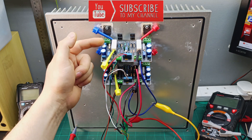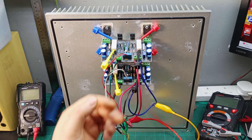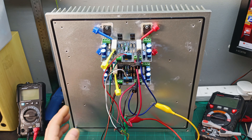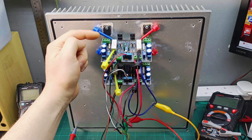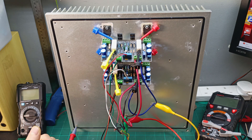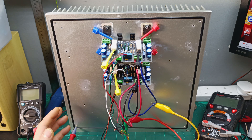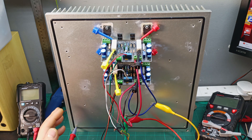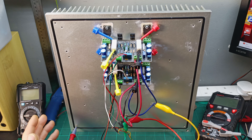These are the PCB boards — one channel here and the second channel underneath. I still have probe tests connected because it's still in testing mode. A few days ago I changed the Zener diode and also tried putting a pair of diodes between the bases of the transistors, because on the PCB board I ran into issues where, with temperature rising, one transistor starts drawing more power, causing an imbalance between the positive and negative rail power supplies.